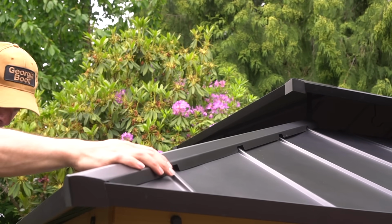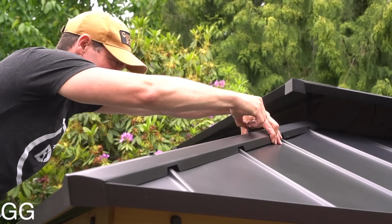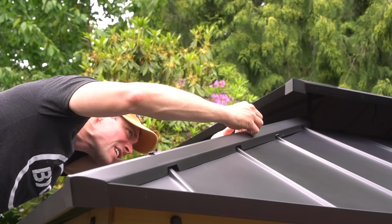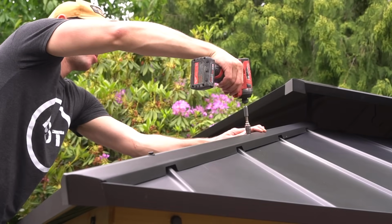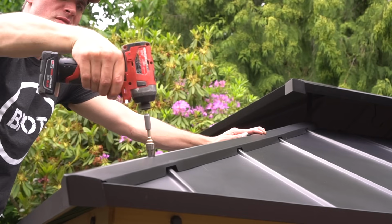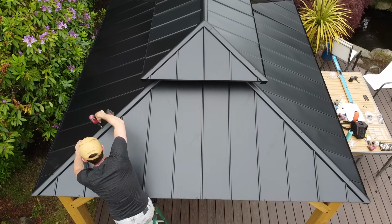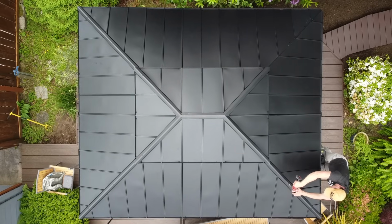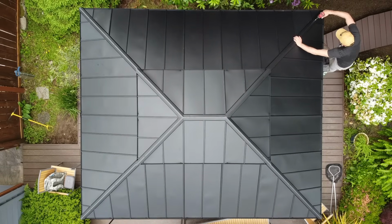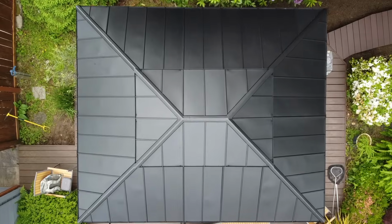And with that said, let's put the final finishing touches on this amazing gazebo. And all it is attaching and securing our 4 corner roof lines just like we did at the very top section of our roof. In every instance, I hand tighten them first and then secure them fully with a drill, but just remember when using your drill, don't tighten them down too much because this is heavy duty sheet metal, but it can bend. But with that said, guess what? We are done!